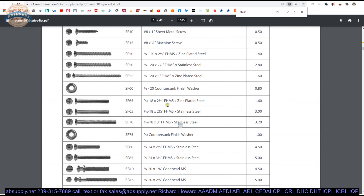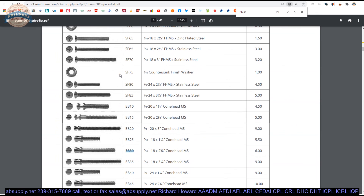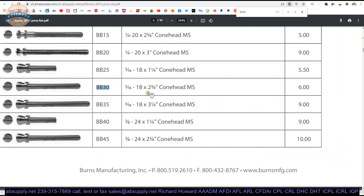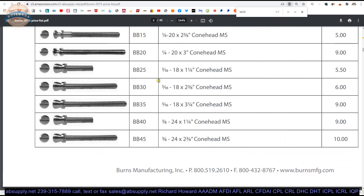In this document you'll have lots of descriptions of different bolts and lengths. You can see that they have a 5/16 by inch-and-a-quarter — that would be for half-inch glass. Then they have a 3-1/4 inch length, which is clearly going to be for doors that are up to 2-3/4 inch thick.